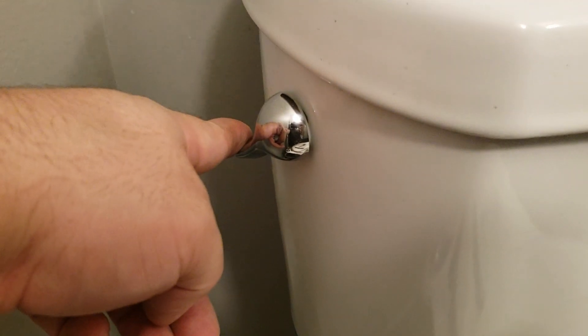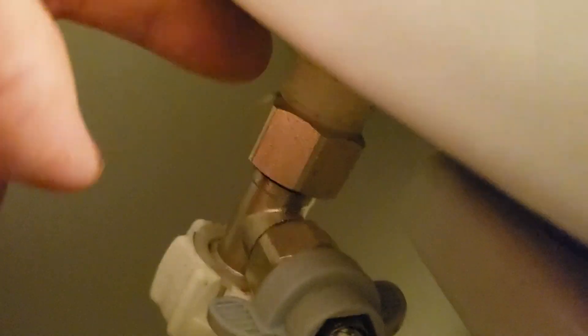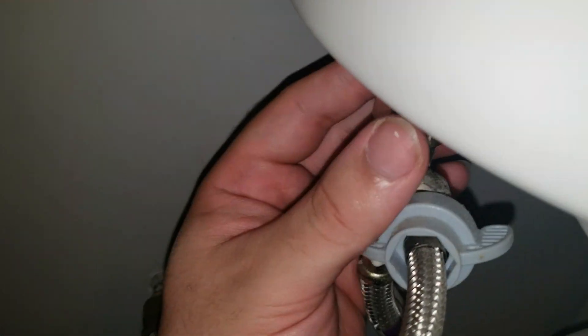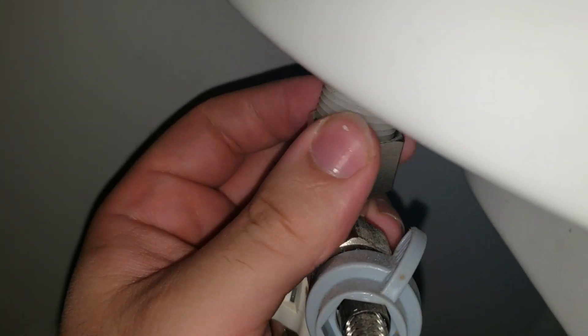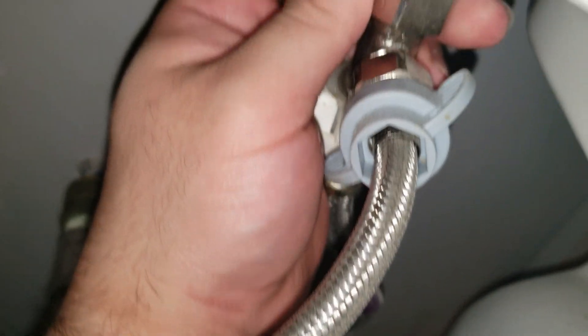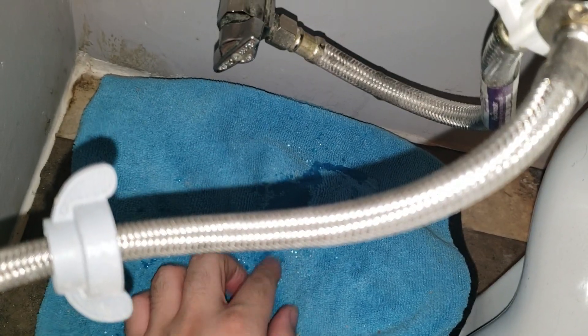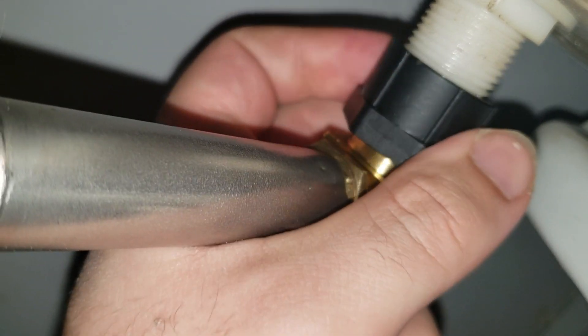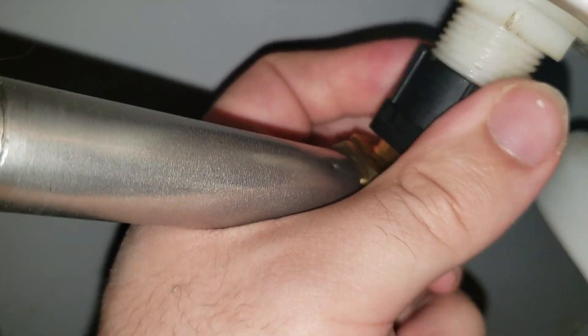Make sure the tank is completely empty. You're going to want a bucket, a towel, something — because when you take off the ball cock that connects to your toilet, whatever water is residually at the bottom of your tank is going to come right out. Avoid damaging your drywall, keep something under it. Give it a right turn — reverse thread — and expect some water to come down, have your towel or bucket ready. Now the 7/8" connection is going to go to your toilet. Since it has a rubber seal, I'm not going to put any PTFE or pipe thread sealant unless I see leaks.